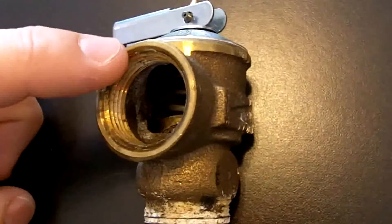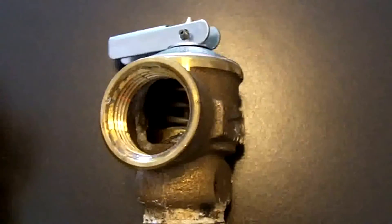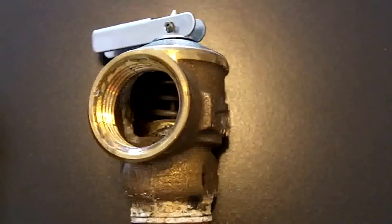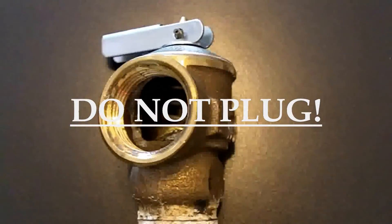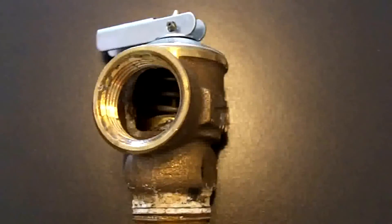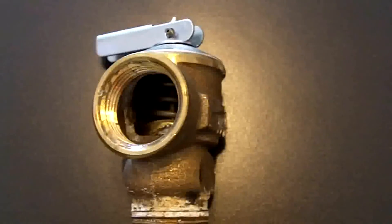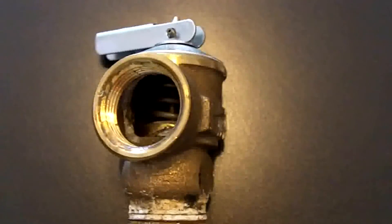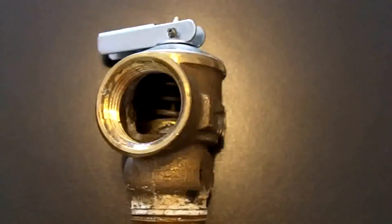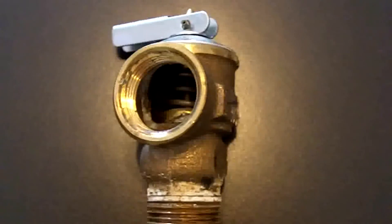As you can see, the inside of this valve is actually threaded. Under no circumstances should a plug be screwed into those threads. We have seen multiple instances where the valve has a slow drip and the homeowner attempts to stop it by plugging the valve. But if the valve is plugged and internal tank pressure continues to rise, there is no way for the pressure to relieve itself. If the pressure in the tank cannot be relieved, there is a good chance that an explosion might occur.